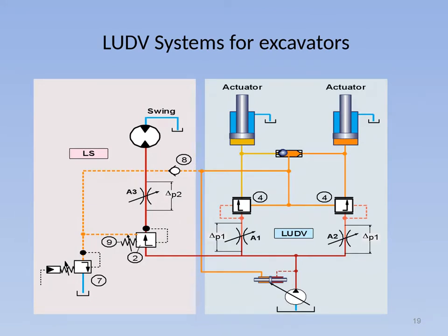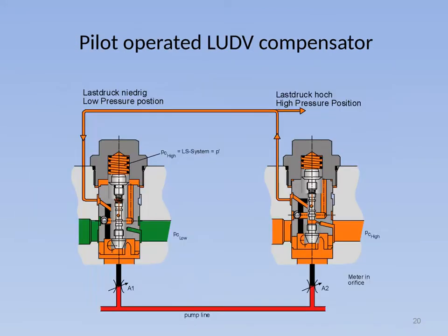The connection from the pump to the actuator is established and initiates the movement. The oil displaced in the actuator flows from B via the outlet orifice (9) back to the tank. The secondary pressure relief valves (2) remain closed as long as the pressure in the actuator port remains below their pressure setting. The main poppet of the combined pressure relief feed valve (2) on the supply side A opens in the event of cavitation in the actuator port and enables feed-in from the tank channel. An optional tank preloading increases the feed-in volume.